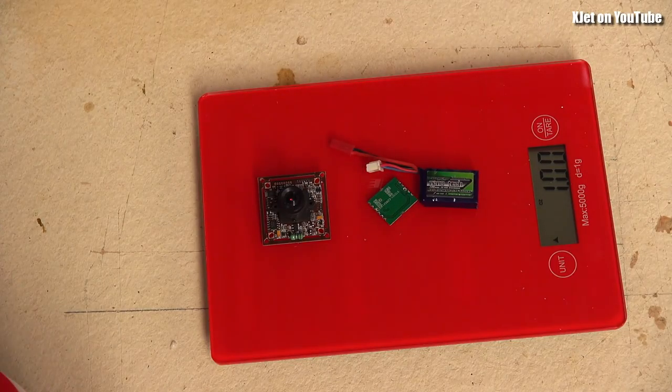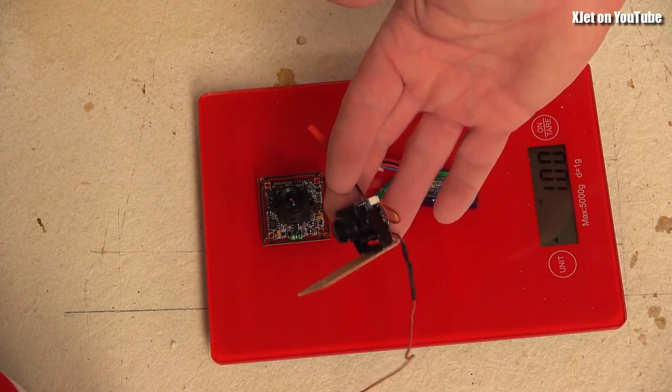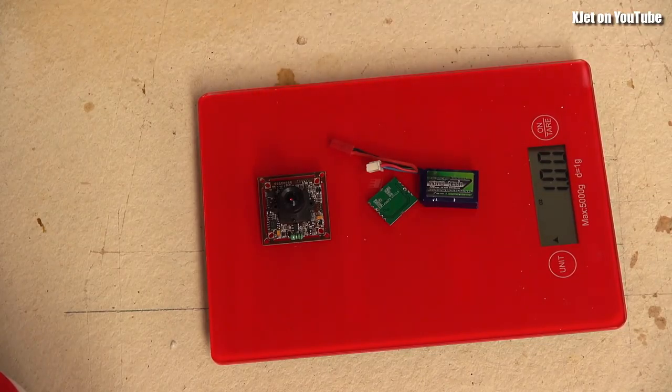Let's say we want to generate at least two ounces of lift, accounting for some extra bits and pieces. Another problem: these board cameras are typically 12 volts, and we've only got a 2-cell battery at seven or eight volts. To manage that, I'm going to show you a little trick — you can use a 555 timer, some diodes, and a couple of capacitors to make your own voltage booster to get seven or eight volts up to 12 or 13 volts to run the camera. May work, may not — another interesting part of the project. I know these cameras usually go black at about 9 volts, so I might also look for a low-voltage camera initially and do the voltage booster as a later addition.